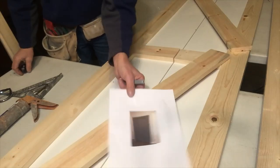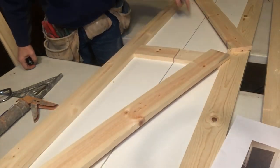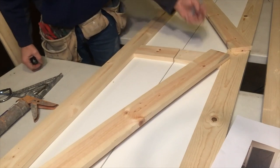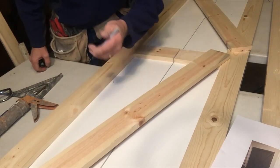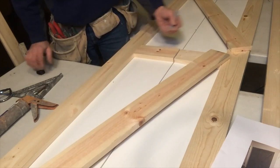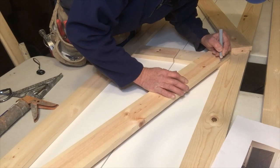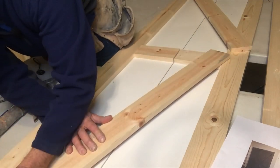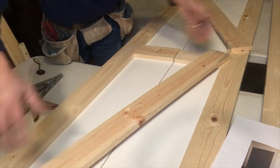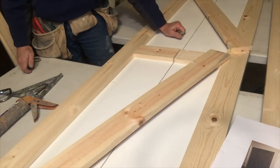You can see from our inspiration design that barn doors have this kind of cross piece that creates a couple of triangles. What we're going to do is over-cut some sizes of the material, mark where they would meet at the top and bottom, pre-cut that, and then set them in place. We'll do that four times and these doors will be just about done and ready for stain.